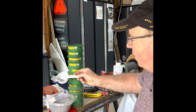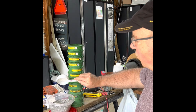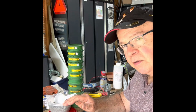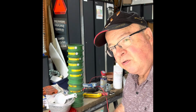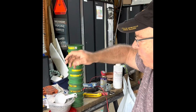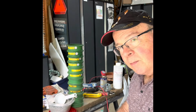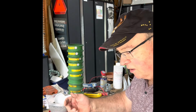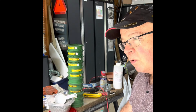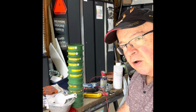Now, the main reason I was doing this, as I explained, was to make this pourable. So I want to have this in a pipe with a valve, well, actually a couple of valves. I want to have the section between the two valves be the ideal amount of hydrogen to add each time to the reaction chamber. So pour this material in the top of the upper pipe, and then open the one valve and close it. Now you have a closed off section of the exact amount you want. And then when you want to add it to the chamber, all you got to do is open the second valve, the closest valve to the reaction chamber. It'll dump that into the reaction chamber, and you don't have to open things. The reaction chamber will remain closed the whole time.